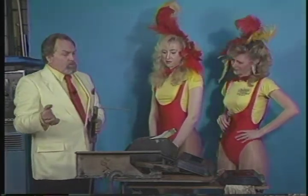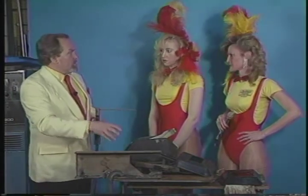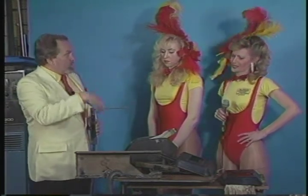All kidding aside, if you're going to practice welding, people often say to put the piece up on bricks. Well, make sure you use fire bricks, and fire bricks are made of a refractory material so that it doesn't react that way. It doesn't have moisture in it. It isn't going to explode.